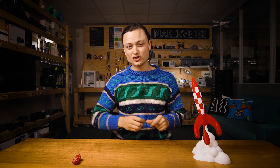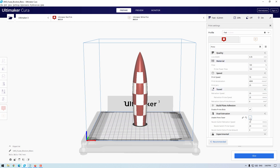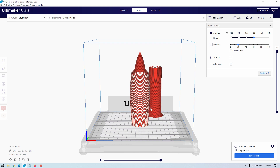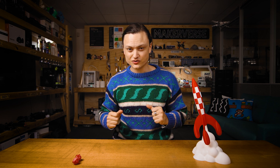Next, importantly, is to use a purge tower and an ooze shield. Purge towers, or prime towers as they are known, are an additional print created on the build plate made to the height of the component desired. Ooze shields are a one-layer-wide wall that encases but does not touch the final model. Both methods are a technique 3D printers use to prime the printing nozzle for each layer. Without either a purge tower or an ooze shield you will end up with stringy hair-like filament covering your desired component, blemishing across the surface. Also check out the guide 'Improving Your 3D Printed Models' which I'll link below — this will help you create a great material print profile so you get the best results out of your 3D printer.